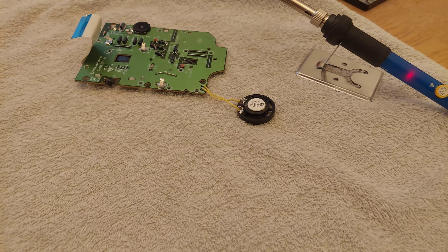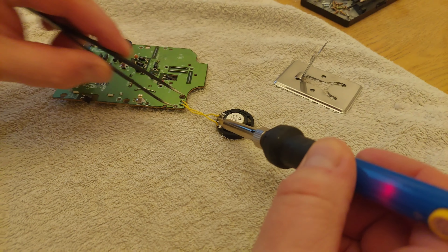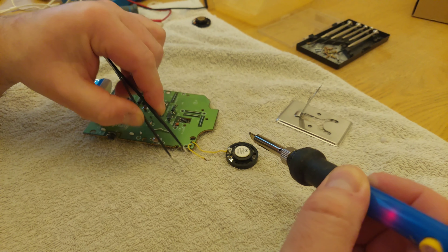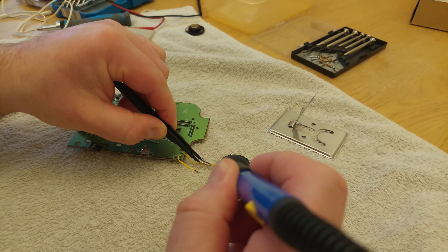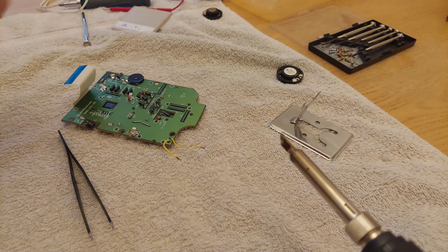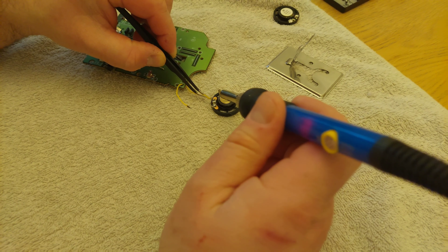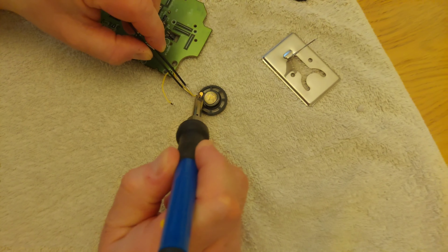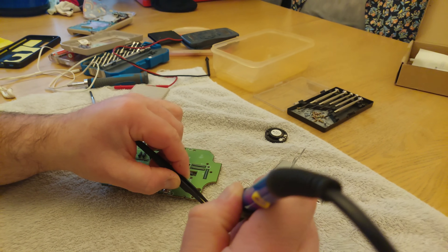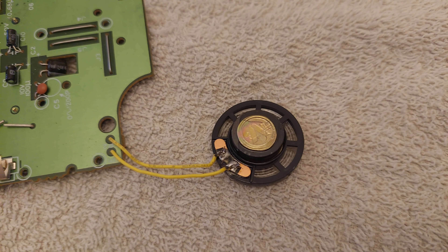I've got someone to assist with filming because I need both hands for this. The next bit is to take the existing wiring off the speaker. I'm just going to hold the soldering iron, get some tweezers, and after a few seconds - there we go, one wire off, and the other one as well. Both wires are off. That's the old speaker removed, and then I'll get the new speaker and put that on. The wires go to exactly the same place as on the old one. I put the wire over where the solder is, heat it up - one wire on - and then do the same with the other wire. Both wires are on and the new speaker is soldered in.